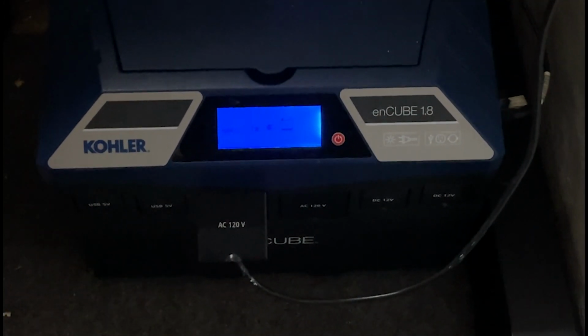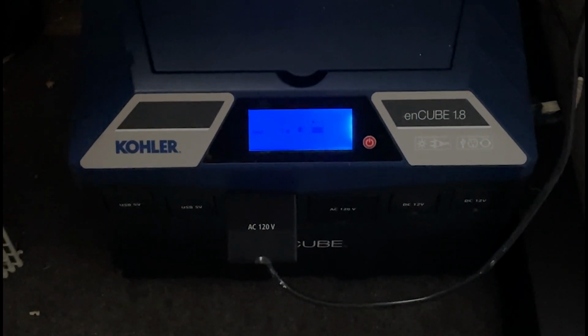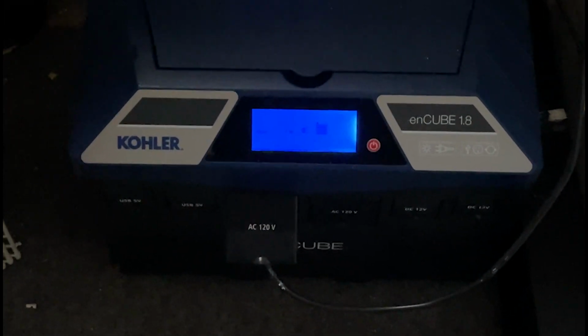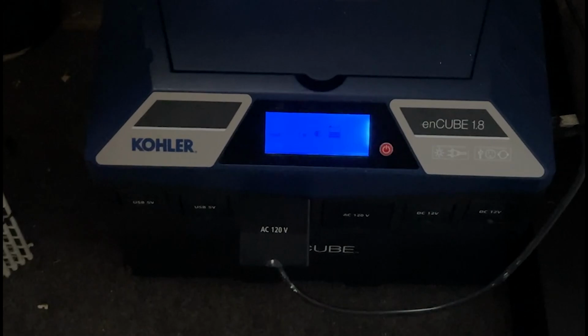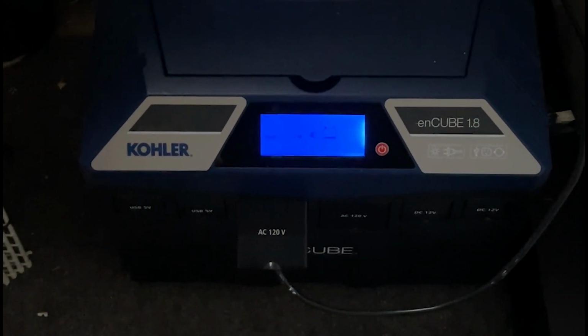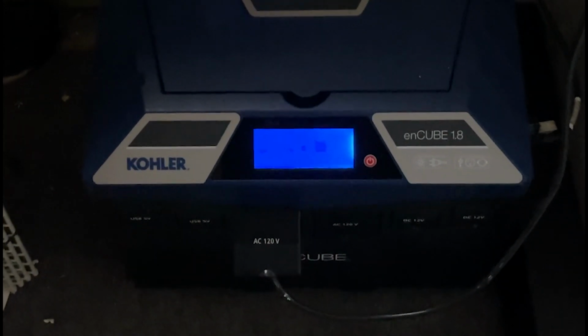This is what's called an AGM battery. So I'm going to want to use another AGM when I run two batteries in parallel with this, and that'll give me approximately 60 amp hours at that point. It's a bad idea to mix batteries. I know some people do it with success, but to get the most efficient use out of each of your batteries, you're going to want to use the same types. But here we're just wiring this up and we're going to expand on it later.